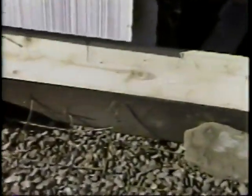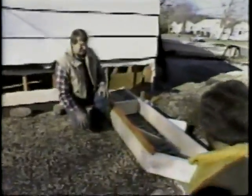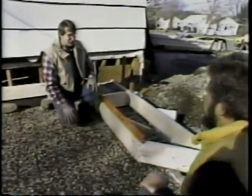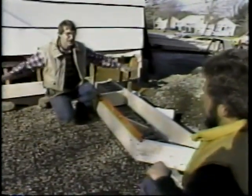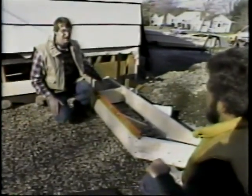All right. The only thing I'm concerned about is the actual pour and everything else. Does this look okay to you? Yeah, that should be good. Now, the reason I put this here was that I figured once we were floating out this concrete slab, we'd have this to act as a guide for us. Right. You're going to use a long timber and go across the whole thing. Right. Fill in all these blocks, I hope. Yeah, that was the intention.